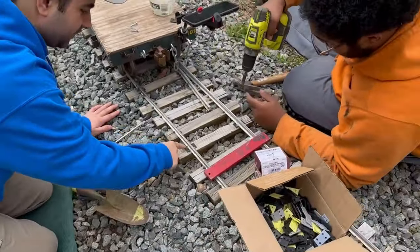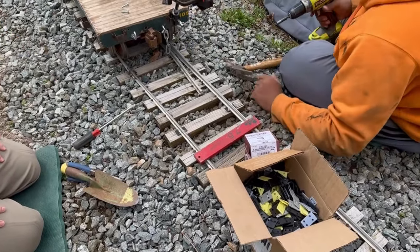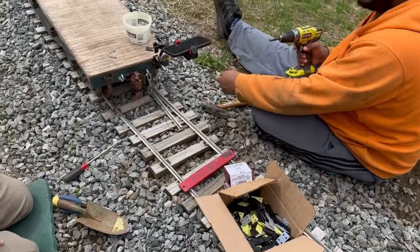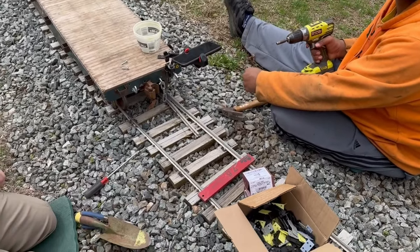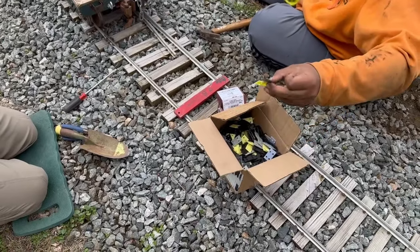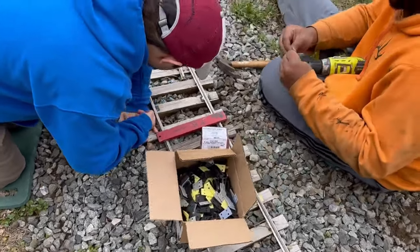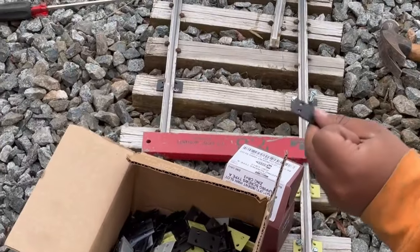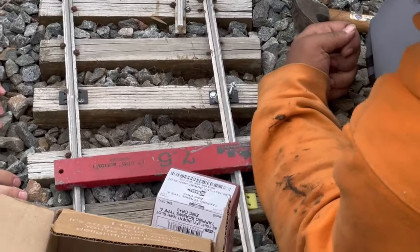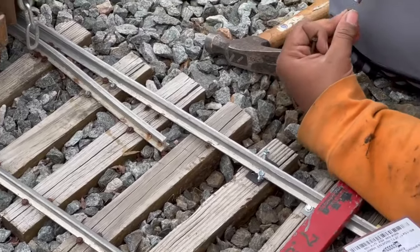This is why people batch things, and they keep the batches numbered or separate. We need to serialize the tie plates. Etch a number in the bottom, just like when he does a run of them. Put, I don't know, 001, 002 run of. That way you know which ones they are. Batch 1A, 1B, 1C. Now that he's gotten decent at them, it's not as detrimental, but the early ones that are in here are just going to be brittle. And you can tell because they have no flex to them at all. The stronger ones you can bend a little bit. I tried bending one of the earlier ones. He must have changed materials at some point. I think he did. That's why when I mailed them to him, I bagged them separately. Well, leave that one in for now.